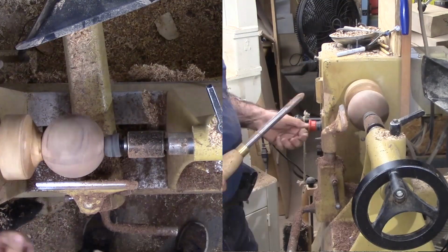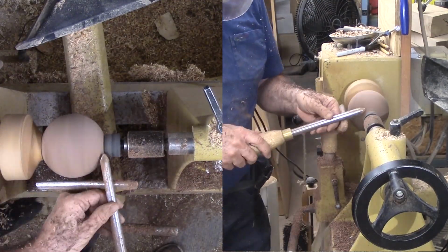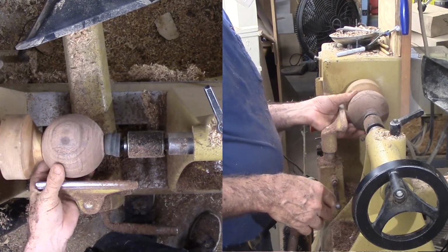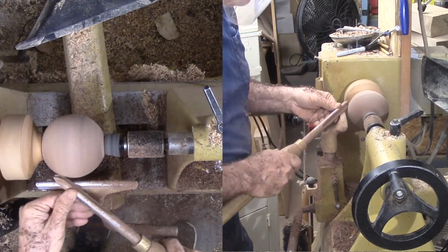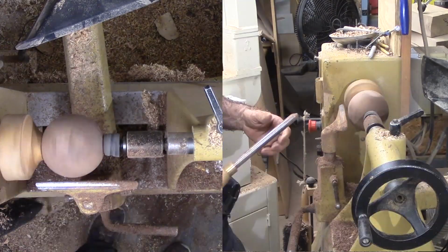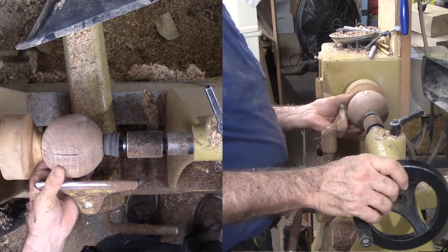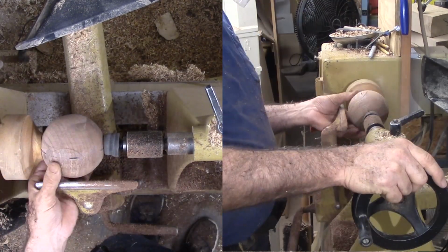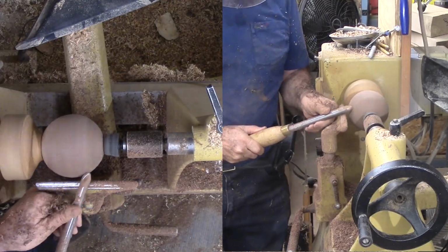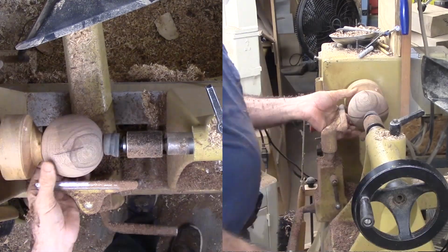I have to keep rotating the sphere because with each cut, I'm making an elongated shape. With the rotation, the elongated ends are cut back to round again. Keeping the tenon area in the cutting zone ensures that it is always in the cutting zone. I think I did 6 or 7 rotate and remount sessions. The tenons disappeared and my sphere is round and perfect. Repeat for each sphere.